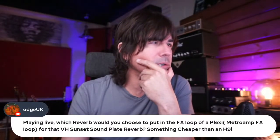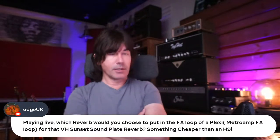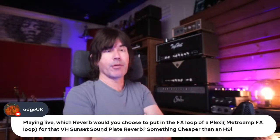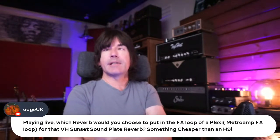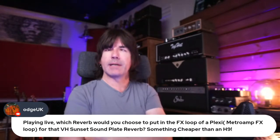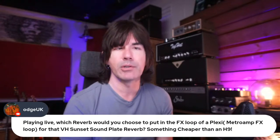But Alex is up there in the super chat too. He says, happy Sunday. How would you describe the tonal difference between a Creamback 65 and a 75? That's a really good question. To me, the 65 has way more forward mids, and the 75 is more balanced. I prefer the 75 for that reason, although I'm a Greenback guy. I like the 65 in an impulse response especially. I like that it's a little warmer than a Greenback because the mids are so forward, and they tend to dominate.